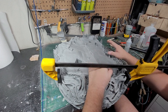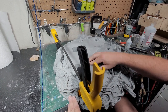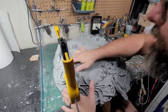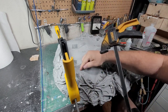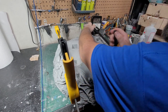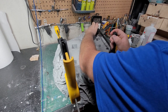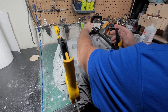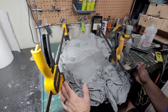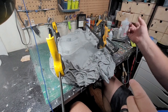I'm going to let this cool down for a bit and then probably heat it up again. I'll probably do this a few times — heat, cool, heat, cool, clamp it, let it sit before I try to epoxy. I want to make sure that when I go to epoxy it, I can do it relatively quickly. I have to mix up a lot of epoxy, and the more you mix up the faster it kicks off. I wish there was a key here because on these I can use keys as clamping points — keys make great places to put clamps, they have good grabbing power. So it's a matter of heating, clamping, cooling, heating, clamping, cooling.